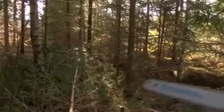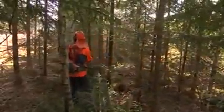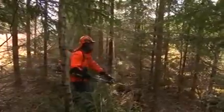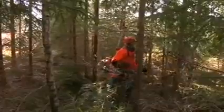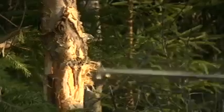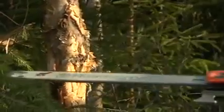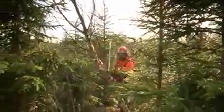Remember that the clearing of undergrowth must be carried out in time. That is to say, 3 to 5 years before thinning, thus allowing the stumps time to decompose before the thinning machine needs to make its way through the stand. The circular blade brush saw and the new backpack chainsaw are two methods that complement each other. New opportunities and a greater interest in spacing could be good byproducts of the new backpack chainsaw.